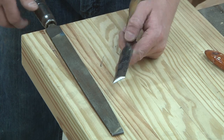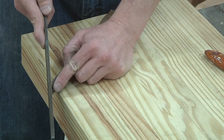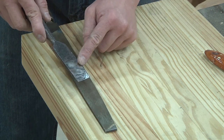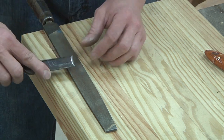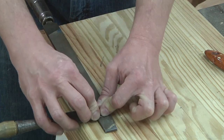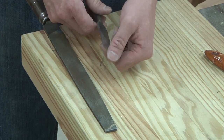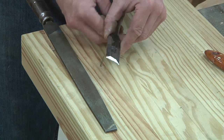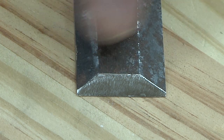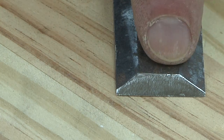I've been busy with my stone and with the file. I've been using the file on the bevel edge, and also flattening the back is important. I've been holding it flat and working long strokes. I can definitely tell it's getting flat and getting a small edge, but if you look real close, you can see the fine scratches in the edge of the bevel.